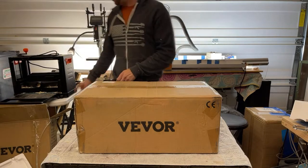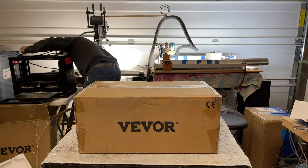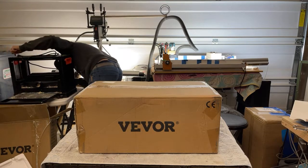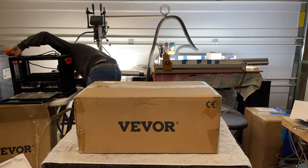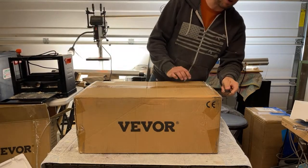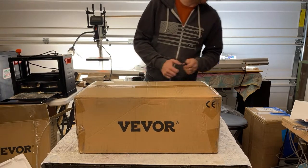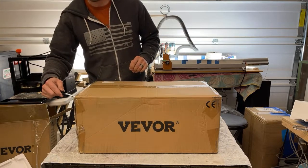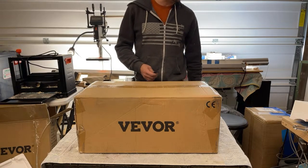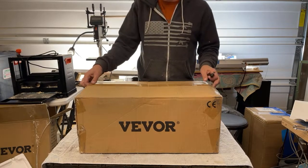The lowest setting on the gauge is 6 millimeters, but I could see if it'll go lower than that. It will not. 6 millimeters is the lowest it'll go. So that's just above a quarter of an inch. If you're doing what I did, I took a 3/4 inch slab of maple that I got from Home Depot and I resawed it. In theory that would leave you with two 3/8 inch pieces, except for the kerf of the saw blade, which takes off about 1/8 of an inch.